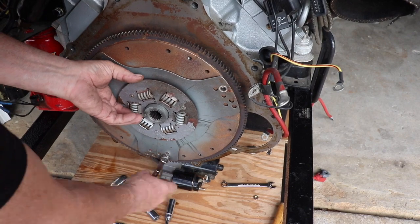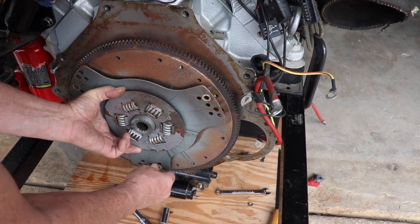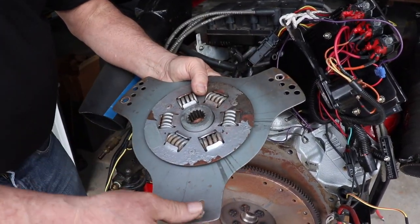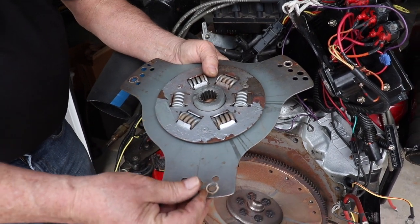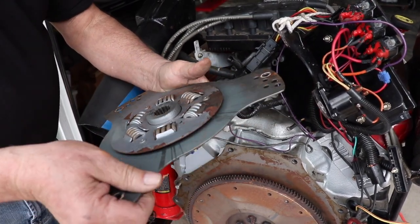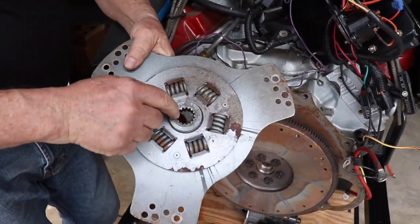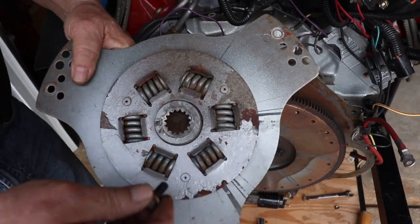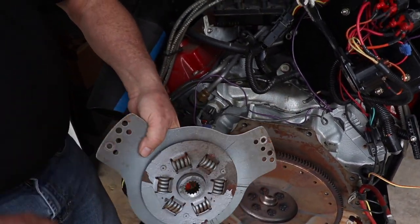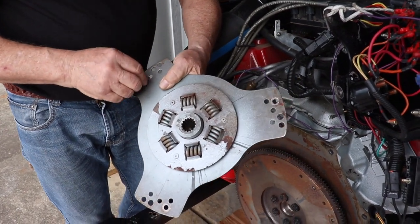We're removing the damper plate. One thing about these damper plates — this particular plate has three spokes on it. The new style damper plate is completely round; they changed them up a little bit with a different manufacturer. Both are good. Some have enclosed springs; this one has open springs. You can see there's not a lot of rust or corrosion on this particular damper plate. I've had transmissions actually fuse to the center hubs from rust in saltwater applications. Those get a little trickier to remove and usually involves drilling holes in the bell housing to get to the damper plates. So those are just some of the things you've got to watch out for.